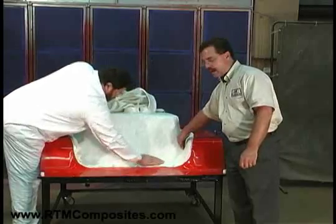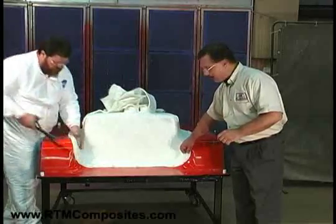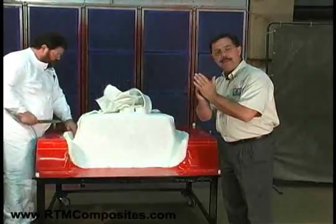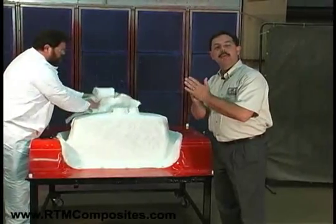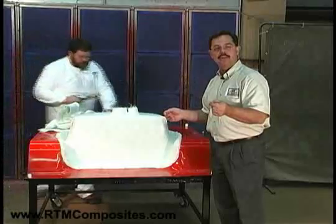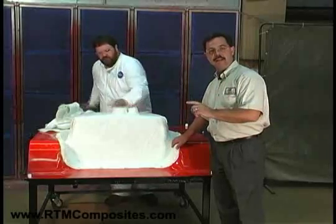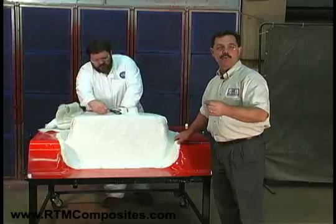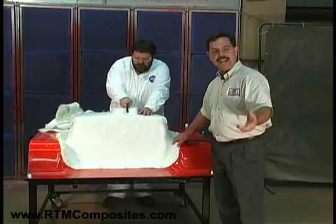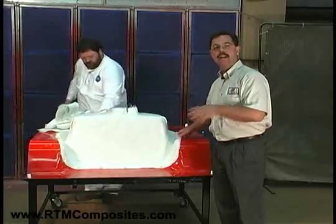So we have glass extending out. Why do we not mold all parts to net? Because we cannot get the glass to remain perfectly to the edge with most shapes. There are occasions where the shape is such that the fiber can be tucked to a corner, an edge, or an undercut, and it will stay there — and if we can reliably assure that, then we can mold to net shape, meaning no trimming needed, like thermoplastic injection molding. Normally we mold beyond the edge and trim back half to three-quarters of an inch. Your original mold design and pattern must consider where the trim line is going to be and where the fiber will extend.